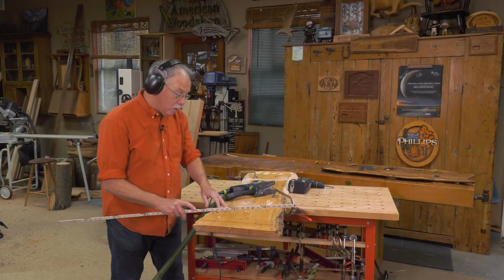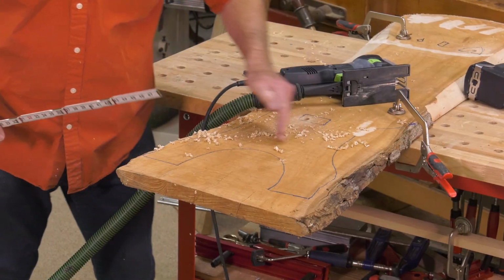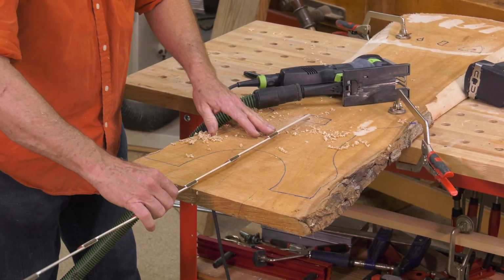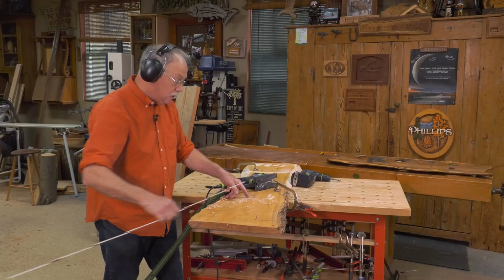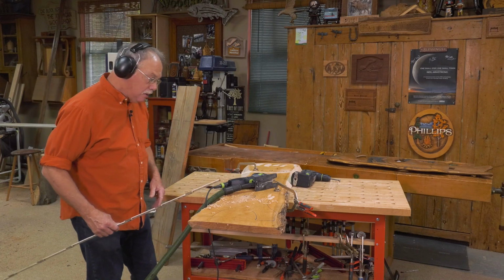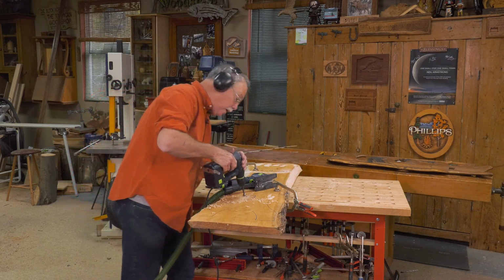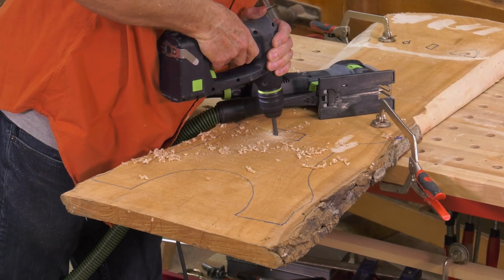From a design standpoint, the bottom feet right here are going to be solid wood left and right, and this is a graceful arch just drawn in. But from the bottom of those feet to the bottom edge of this keyed hole, it should be 14 inches. It just works best for a person 6 feet tall. So I'm going to sculpt in the bottom, and then after that, I'll show you how to cut the square or rectangular keyhole. Call that square, it's a rectangle.